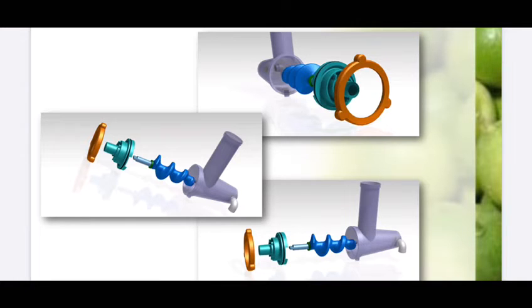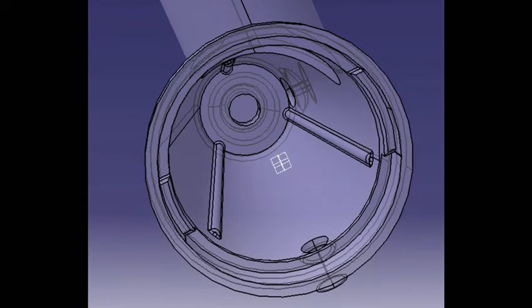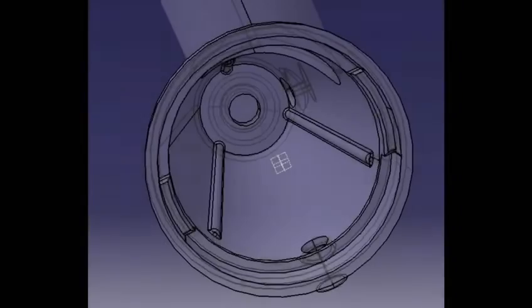Lemon enters the machine uncut, so it needs to be cut in half. This action will be done at the connection point of the inlet channel and main body. That line works as a blade. Some ribs are needed to prevent the lemon from spinning inside the chamber and just push the lemon forward to be squeezed at the end of the chamber.